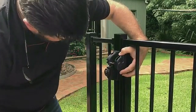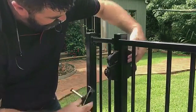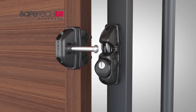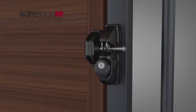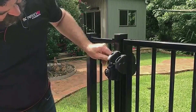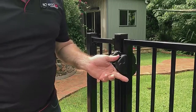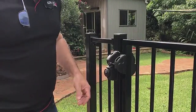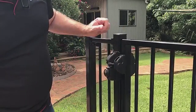Take your striker pin, position it on your gate, and align exactly where it needs to sit. I'm going to scribe the inside hole so I can insert my screw. You can see it's sitting a little bit high — I have elongation in that screw hole — I just want to make sure that the latch sits exactly in the center, then screw the rest of the latch body off. Now that it's locked off, my striker and latch should be working from either side.